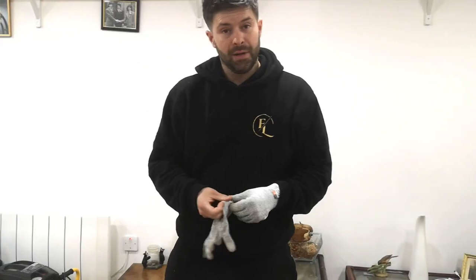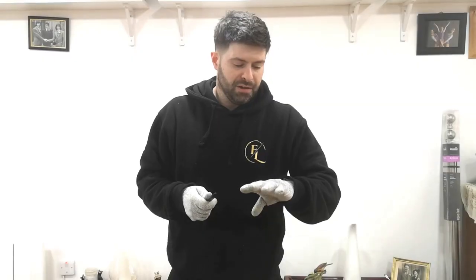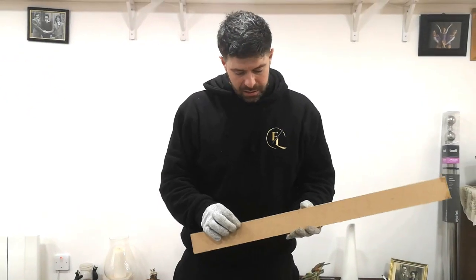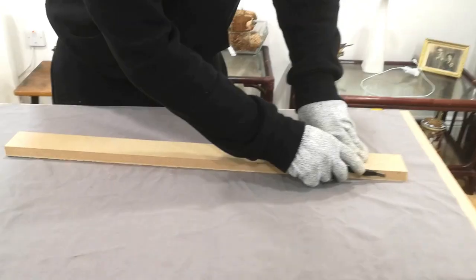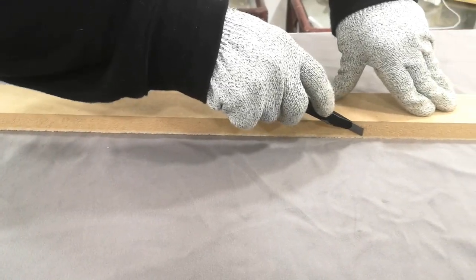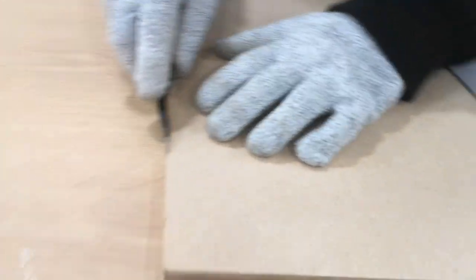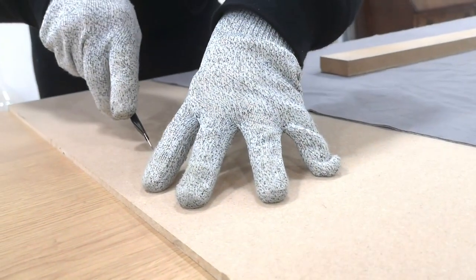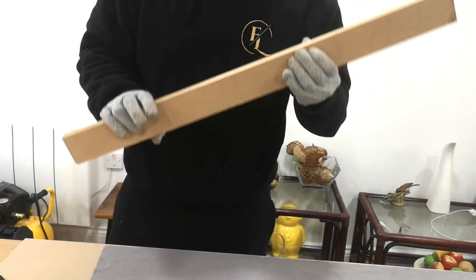First of all, in my opinion, always wear gloves. I've had two or three times I've been to the emergency room with Stanley knife cuts over my fingers. I got these on Amazon - they're just standard cut-safe gloves; you couldn't cut through them. Secondly, this template I'm using is 25 mil MDF. The minimum I would use with a Stanley knife is 12 mil, because then you've got no chance of the blade riding up. I've had the knife jump up and over my fingers before - ended up in the emergency room for three hours. So minimum 12 mil, and wear gloves.